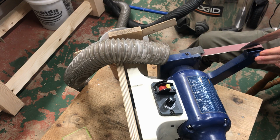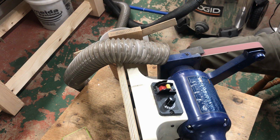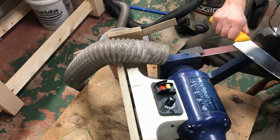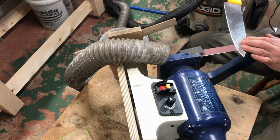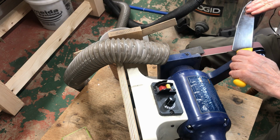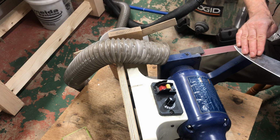No, so here we're just smoothing out the grind on the back, rounding over the spine just a little bit to make it a little bit more comfortable and aesthetically pleasing. And now we're coming in at a low angle, creating that secondary bevel. Nice and slow, light pressure on the slack belt. Checking with every pass, making sure you're getting it to the heel and to the tip without rounding anything up. Again, nice and slow. Checking the work again.